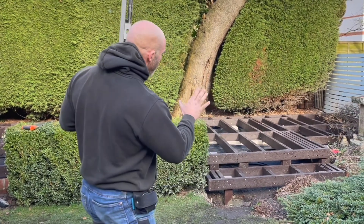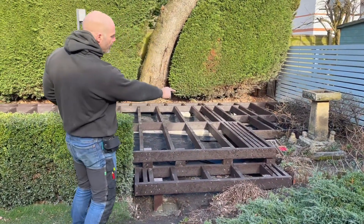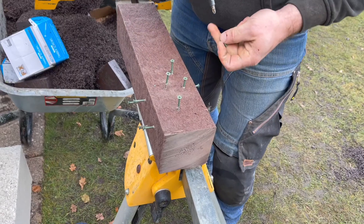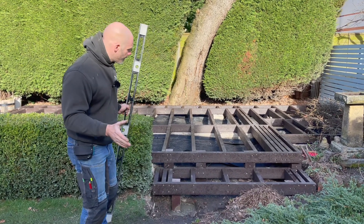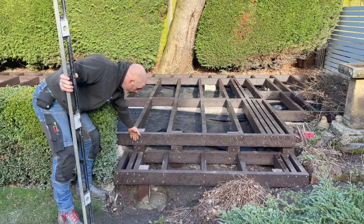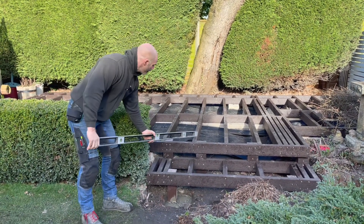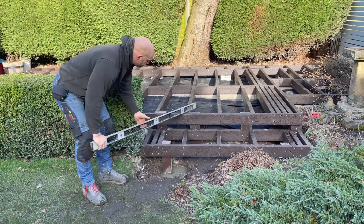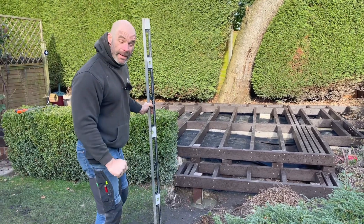A couple of side notes on this step now it's in situ. The posts are concreted in — same plastic posts as the ones used in the far corner of the deck. Before we concreted them in, we wound a few screws into the bottom of them and left them poking out so that it grips the concrete — a trick I've used for years and years. We've also put some blocks, just using off-cuts we had, to facilitate the fascia board — that'll make more sense shortly. In terms of its final height, we took an average of this area, found our total distance, and put the step directly in the middle to make sure we've got two equal steps up onto the deck. So that's the final little piece of this deck frame.